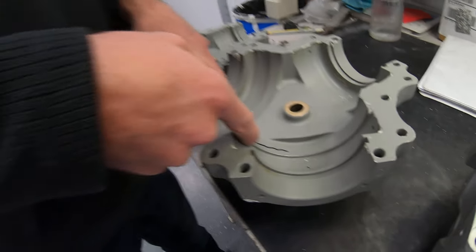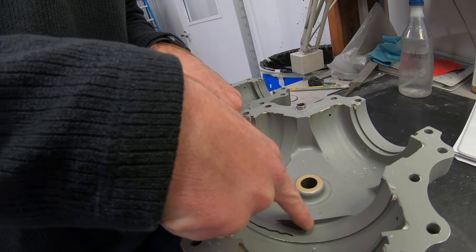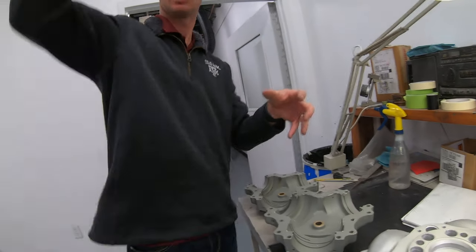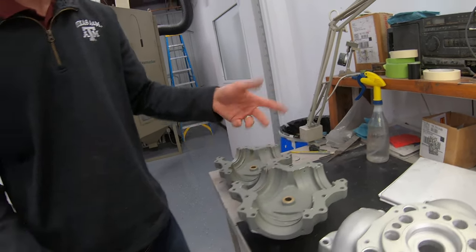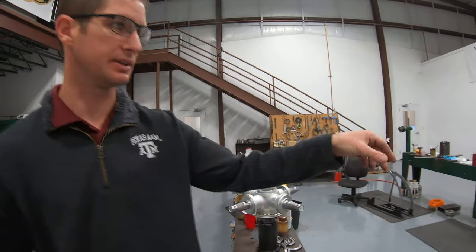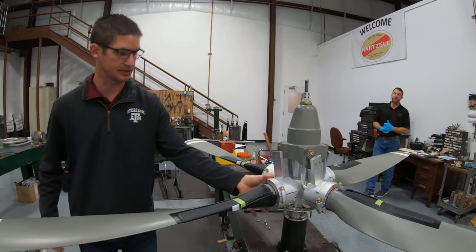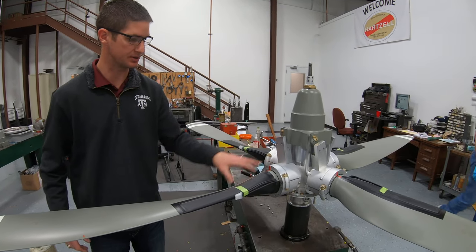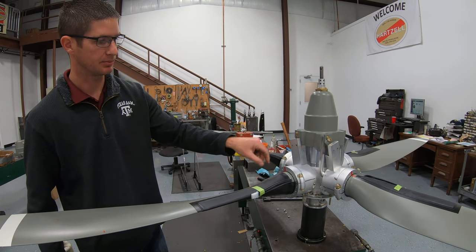This hub was in an impact — see that hub? That lid has been pushed. The trained eye will know what you're looking at. So this is an impact where that blade torqued and pushed in that hub. This is a critical area which, if it's pushed, can cause cracks. Once the blades are installed and the clamps are installed, it looks like this. You'll see these clamps all have fresh cad plating as well — there's zero corrosion. All this locking hardware — these are factory new components, we don't reuse those.